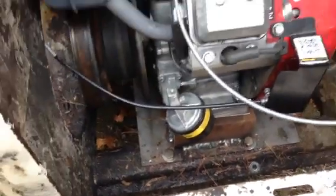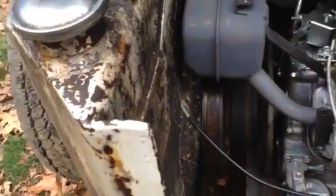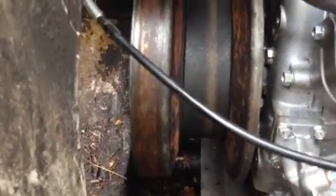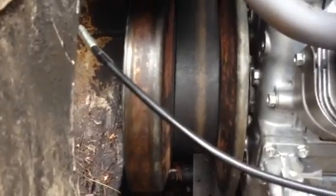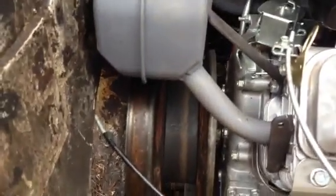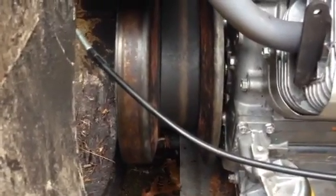In order to run the jack shaft, I got a hold of a snowmobile secondary clutch. I learned this from Farmer Phil, who also has YouTube videos — much thanks to Farmer Phil. I removed the clutch mechanism from the secondary clutch and then used bolts to space it at about an inch and a half from center. That sets the drive belt at one speed — a speed that's good for around the yard. I don't need to go faster and it's got enough power to move piles for my purposes. For the spacing, I just bought a whole bunch of nuts and added nuts, so it's fixed, and as you can see, it's bolted together.